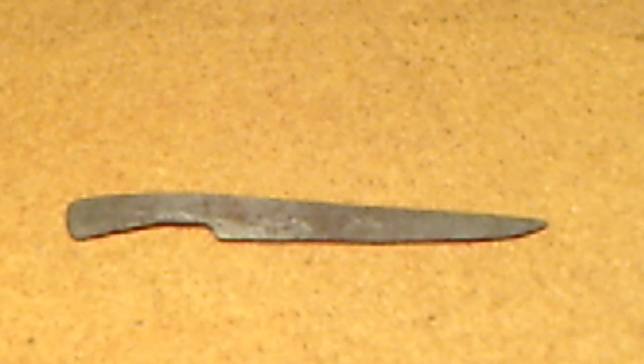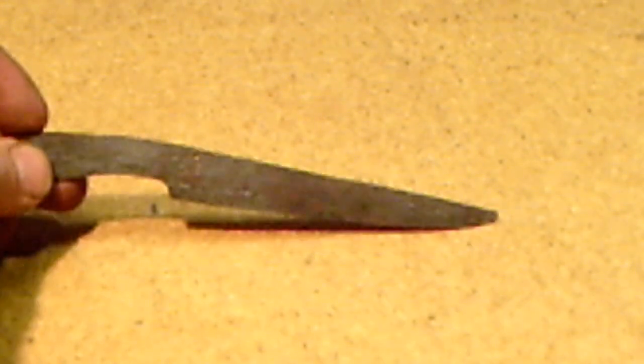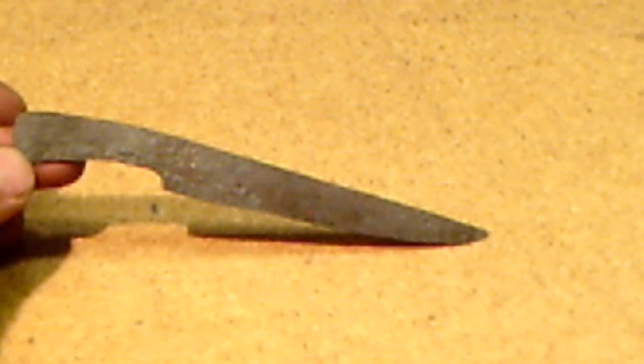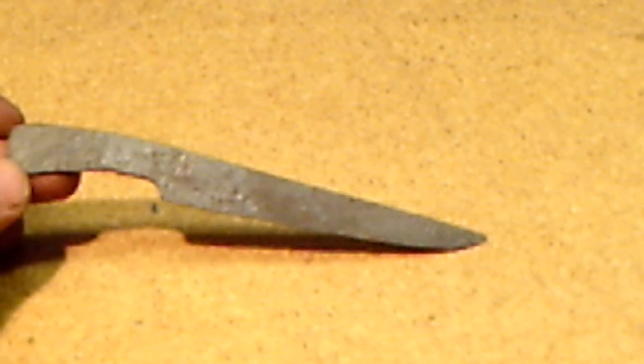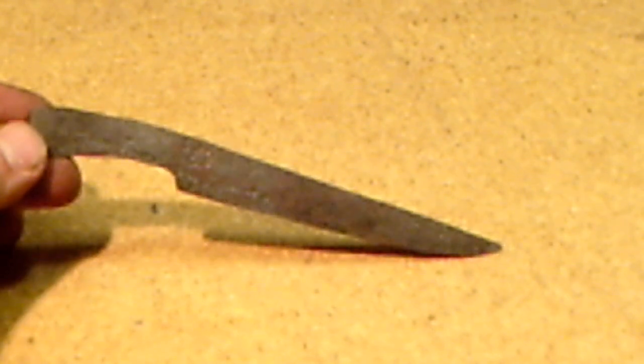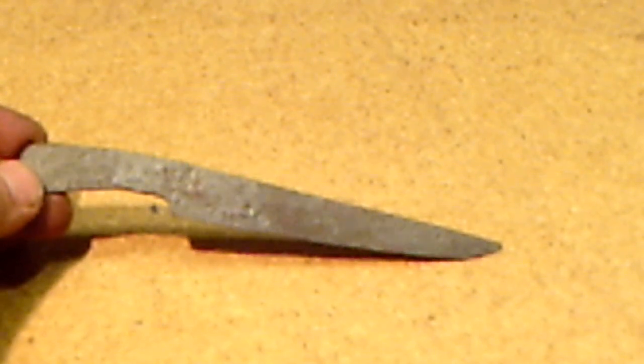This is the finished product of the knife we just forged — straight out of the forge, without touching it with a grinder or file. We've normalized it and straightened a couple of little kinks. We're now ready to grind in the profile and further refine the cutting edge, which we're going to do in part two. You want to get the knife as close to finished state as possible — it cuts down on time you have to spend on it, especially if you're finishing by hand with files, which can be a lot of work if you've left a lot of bulk.